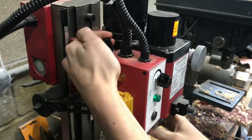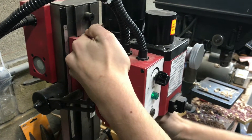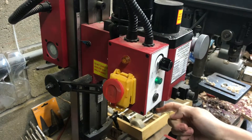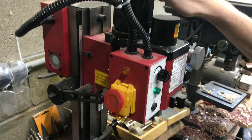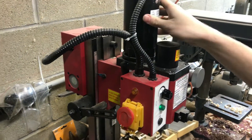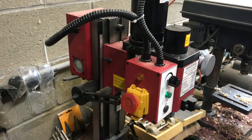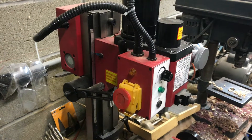So it's really important when you're changing gears to make sure you rotate the spindle a little bit to make sure that the gears are engaged so that your spindle will be connected to your motor. So if you hear your motor but don't see your spindle running, make sure you check that lever and make sure that your gears are engaged on your Harbor Freight mini mill.